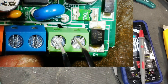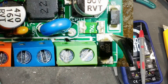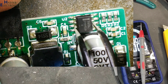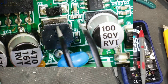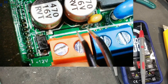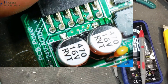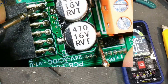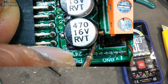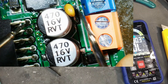The AC or DC 24-volt input goes through a fuse, then a protection diode — a one-way conductor — and the supply reaches the buck regulator. The buck regulator drives this inductor and freewheeling diode, then voltage reaches the two parallel capacitors. That voltage passes through a one-way conductor diode to this pin. If this diode is damaged or missing, voltage will never pass to this point. So the problem was this capacitor and this diode.